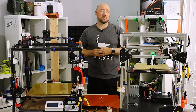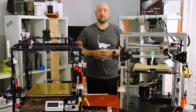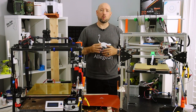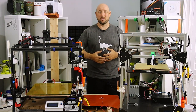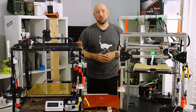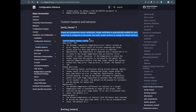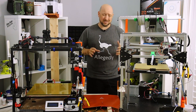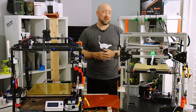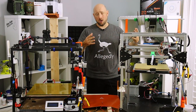Second, while I will be discussing a number of safety measures, the first safety measure that should be enabled regardless of your printer make or model, regardless of the type of heated bed you're using, is thermal runaway protection in your printer's firmware. Thermal runaway protection can safeguard against most common heater issues including broken connectors, bad thermistors, bad heater cores, even misaligned fans, and enabling it should be a no-brainer. Marlin has it enabled in most of its configurations. Klipper also has it enabled by default. However, there are a number of manufacturers, especially on the lower end, that fail to turn on this basic safety feature. If you don't have it enabled or don't know if you have it enabled, stop this video right now, go turn it on, and we'll be here when you get back.